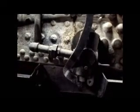There's also a dummy way to get water up there. Say if you're just filling the boiler, you can connect the hose to that. See, I'm shaking the grates right now, letting some of the ash down into the pan. Here's that blowdown valve I was talking about earlier.